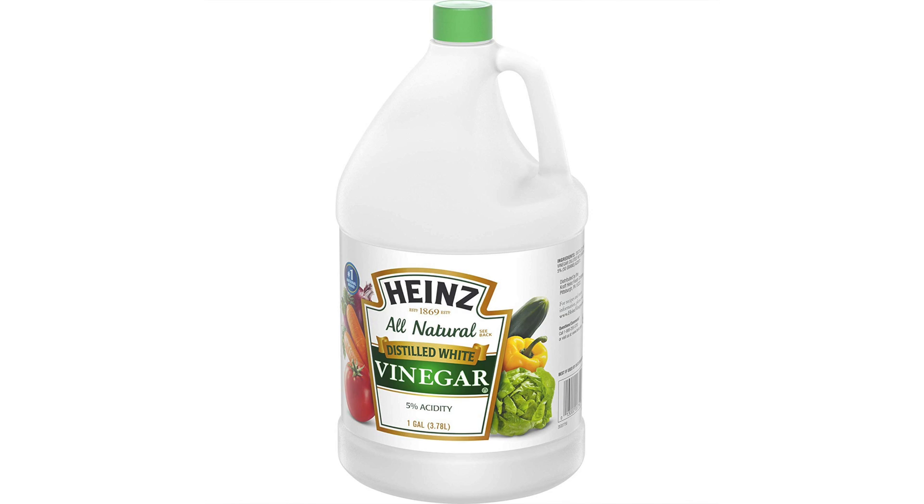Now a little trick — if you want to save money on this, I've had a water heater representative tell me that you can use vinegar instead of a chemical to do this. But if you use vinegar, you need to let it flush for about an hour and a half to two hours. Also when you use vinegar, make sure you turn that unit off. Using vinegar, you would need about three or four gallons because you are going to empty the water completely out of this tank. You're going to clean the filter on the inlet side, pump it full of vinegar, and let it circulate through there — an hour and a half to two hours, and that can save you some money.